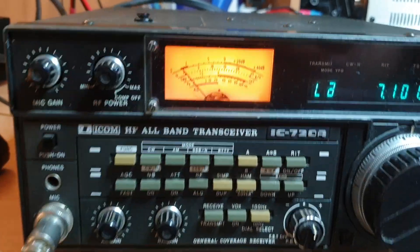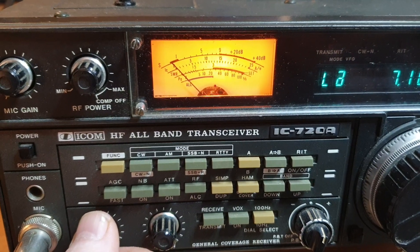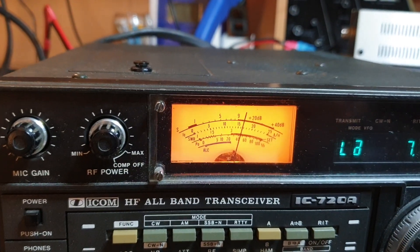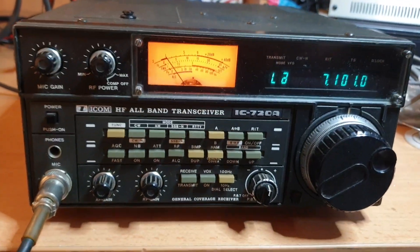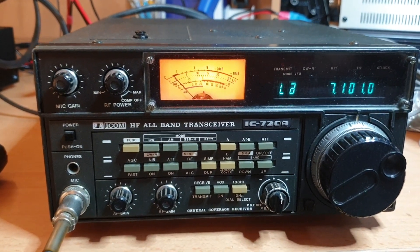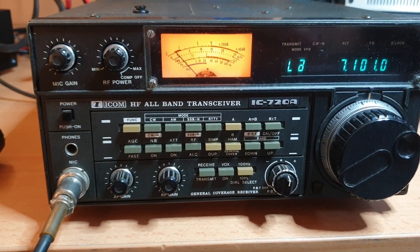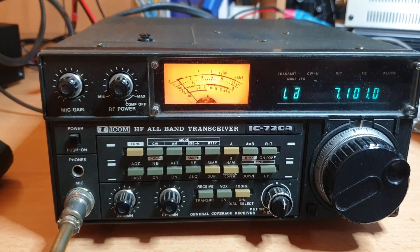This wasn't a fault in the radio — it was just a characteristic. I wonder if it's just a little bit off frequency. Let's try something. Go back down to 0.1 again. I can hear it at 0.1 minus 123 — I can just hear it in there. So, not staggeringly bad. Let's put 50 microvolts into it — should be about S9 or so. Just a little bit over S9. That's pretty normal. So, receive is fine, no problems. We just know that when we test newer post-2000 stuff, we're able to get to minus 123 noise-free. With this, we're not quite getting to minus 123 noise-free, but 0.5 of a microvolt is still quite good.